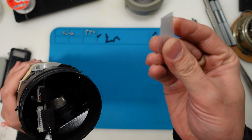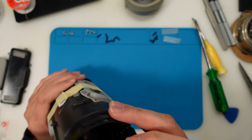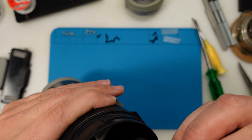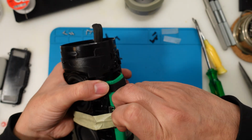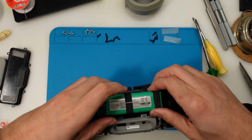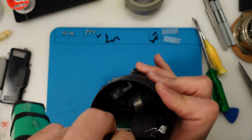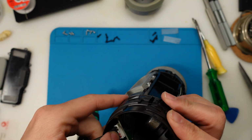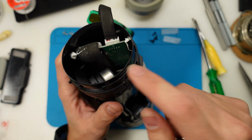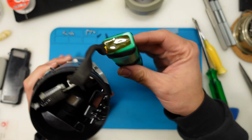Of course, making these two things from a sheet of plastic helps a lot. Battery connector to check if the battery is giving enough power or not to the speaker. But now we can remove the battery and plug it in from the outside. Yeah, and now we can access the connector to test voltages while it plays. So let's see if the battery is giving enough juice to keep this speaker alive.